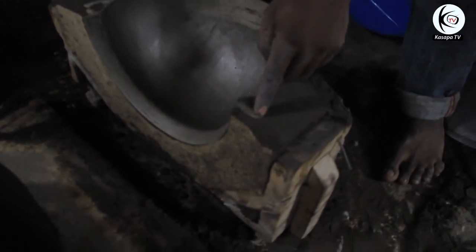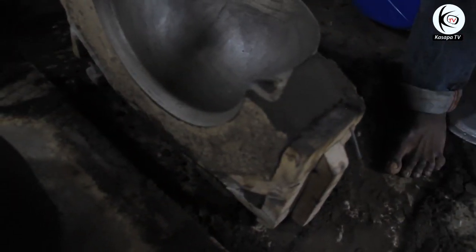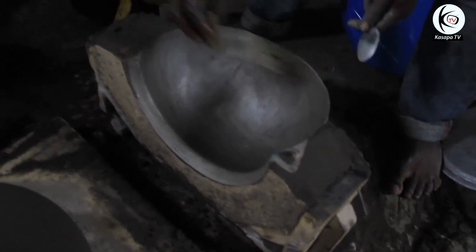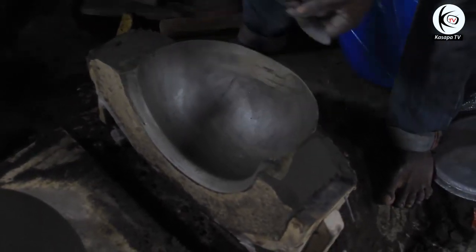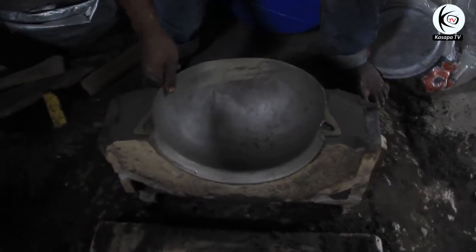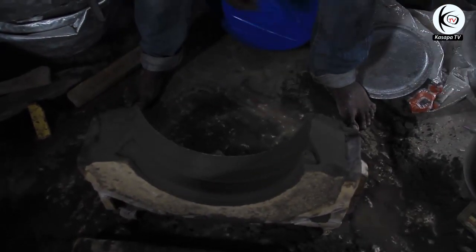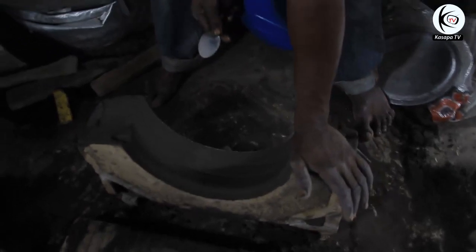Carefully removing this half, you find out that the ear of the pot was not damaged — the molding is correct. You just have to put a little water on it, beat it up, and take the pattern off — that is exactly what he is doing. You can see the pattern has also been made, and the lines on the metallic pattern are also correctly seen in the soil molding.